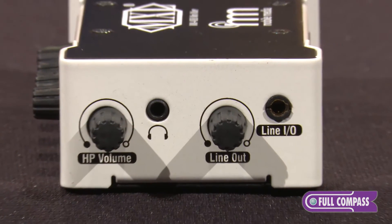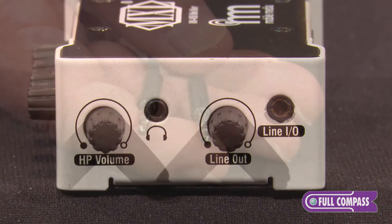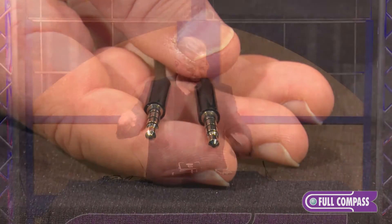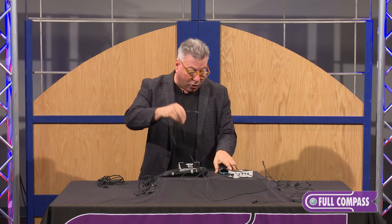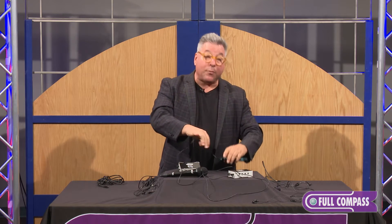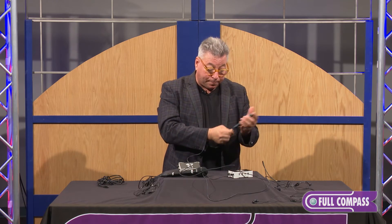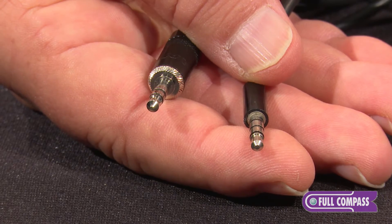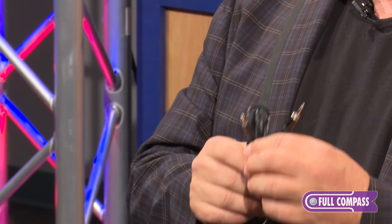To go out, we have a line out here. It comes with two analog cables: one is the TRRS-to-TRRS, so this plugs in on one side and on the other side you plug it into your phone. It's a six-foot cable, so you can keep your mixer a good five to six feet away from the camera. It also comes with a TRRS-to-TRS cable, which means it will also work with a DSLR or a camcorder — because all DSLRs and camcorders have audio in, they just don't have power, so they need a different input.